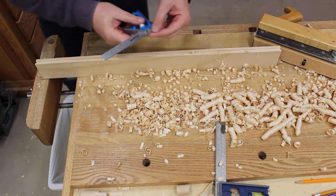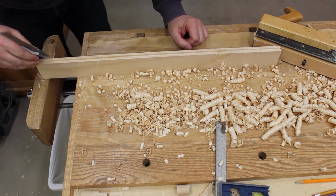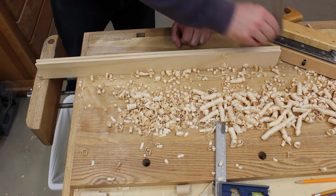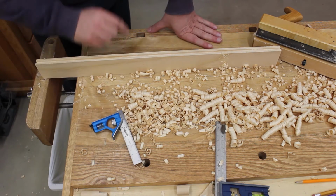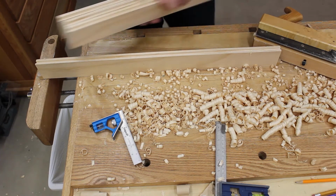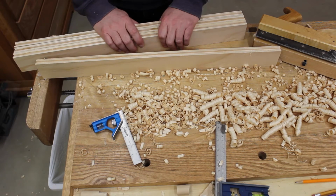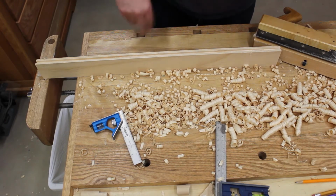And then on my combination square, I have a 1/4 inch set for the depth. And then we'll just check it along here until we get all the way down to a 1/4 inch or just a little bit over it. So almost done with these. I'll finish this one up, and then we have all the stiles and rails almost done for the 3 end panels.